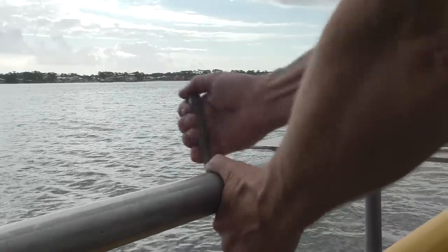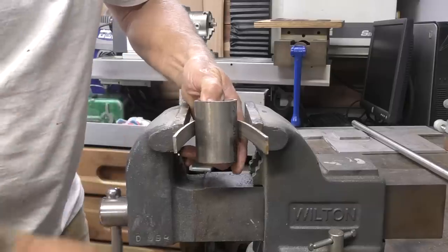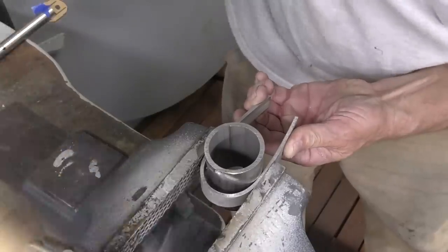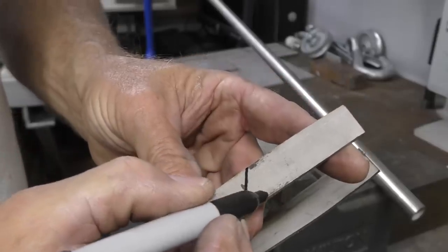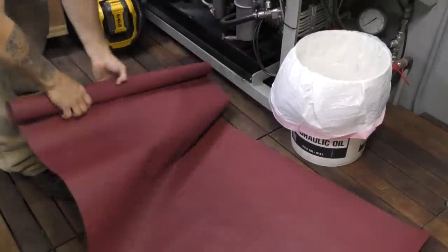I just also thought I was stronger than this too. So now it's gonna bend. Just bend this right to the pipe. Needs a little tension relief right there. That works for me. And the weld will fill in for the sins, so we'll just make a couple little straight cuts right there. Roll out the red carpet for the shavings.